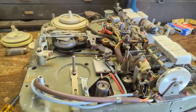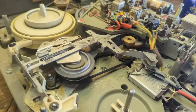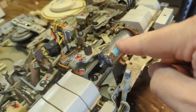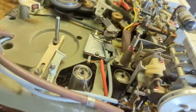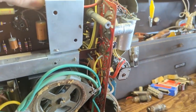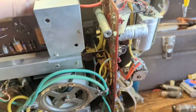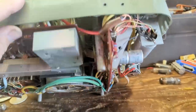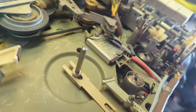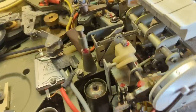It's been sitting out in the sun for most of the day — let's see if that belt's going to hold. It seems to be pretty happy. The capstan is doing a good job of rotating. Looks like our eye tube is lit — wait, something is burning. Something is burning. Plot thickens. I got a bunch of oil and stuff all over the contacts, and there's a shorted electrolytic capacitor here. I'm surprised — usually these tape players weren't used much so the electrolytics don't have heavy use, but this cap is out.